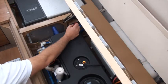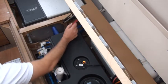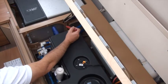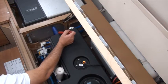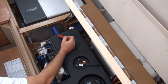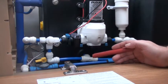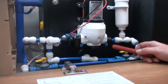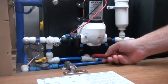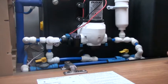If I reach across the top here, you'll see there's a pipe leading into the water tank — this is the fresh water tank you can draw from to the taps. It comes in from the wall and fills up. There is a vent which comes out of the water tank and goes down into the floor — it operates for two reasons: if you were to overflow the tank it runs out of this pipe and down through the floor, and if you're drawing water from it, it prevents a vacuum by allowing air back into the tank to replace the water you're taking out. Down below, what I'm more interested in is how we get the water into the main system. We have our onboard pump here. The water from the tank comes from this junction — you can see it coming from the tank straight into this T. Before going that way, it also goes to the right to a dump valve where I can get rid of that water when needed.